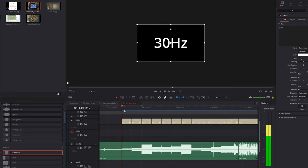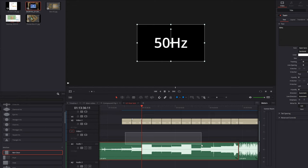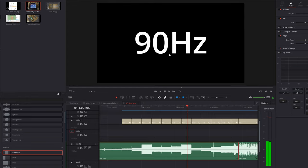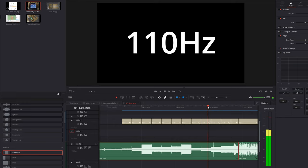And you can see kind of a trend here. So you start over here at 30, not too loud. 40, you can definitely see an increase in volume from 40. And then when it hit 50, it must be like a resonant frequency of 50 with this guy in that box, because it is definitely, it's almost as loud. Actually, I think it's a little louder. Let me see here. That's about the same loudness as 90 hertz right here. See that? And then it kind of has a 90, then it goes down again. 100 gets lower, 110, 120, and then yeah, I kind of just didn't go after that. So it's kind of cool.